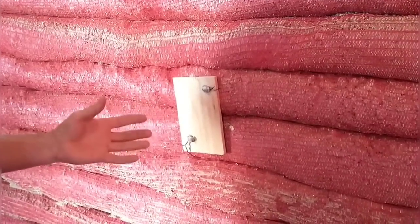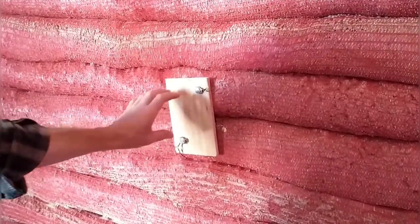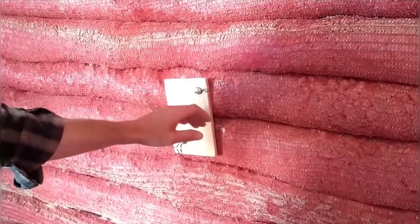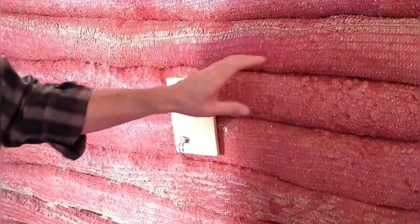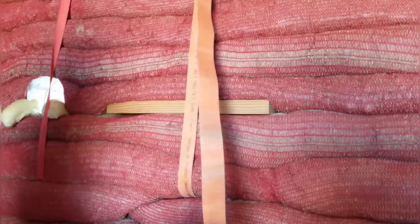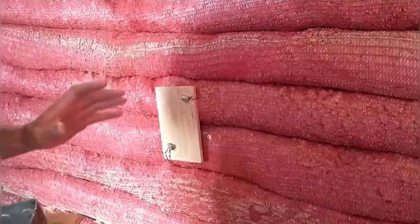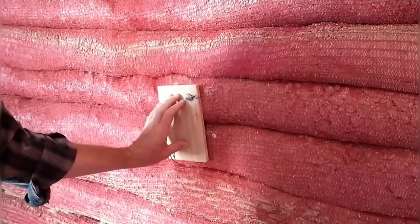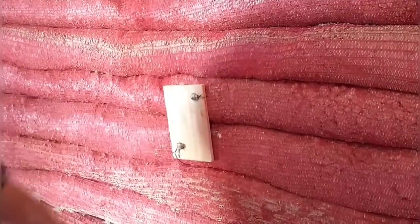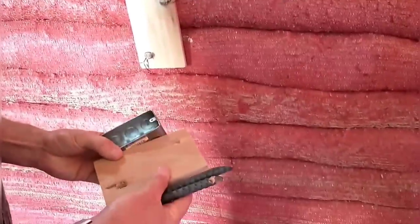In retrospect, it would have been easier to just put a piece of 2x4 in the bag everywhere that you want an electrical socket or outlet of some kind, and then you can just attach the outlet directly to that board that's in between the bags. Kyle did do some of that through the building and put some boards in, but unfortunately we didn't think about it early enough to make accommodation for all the electrical boxes, and so we're having to figure out another solution.